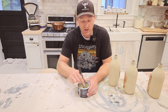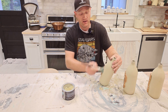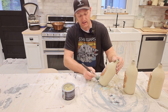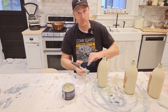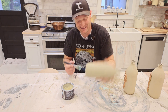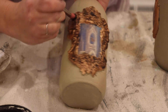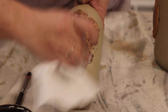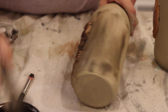I'm using a 1¼-inch stencil brush — it works really well on wax. The bristles are nice and soft and this wax is really soft and creamy, so I'm not reactivating paint and I can get it on here quickly. The reason we're clear waxing first is that we're going to dark wax, and the clear wax enables us to control how much dark wax absorbs into the paint. The copper parts did not need to be clear waxed because they already have a built-in sealer. Now I'm coming in with dark wax over everything — I like to use the small brush to get down into the detail.